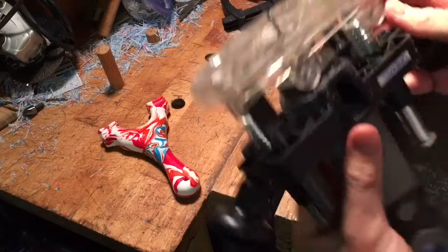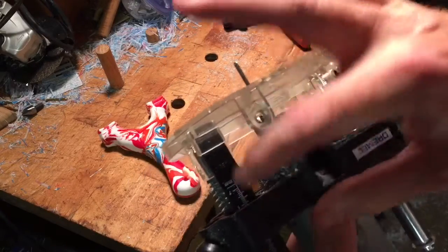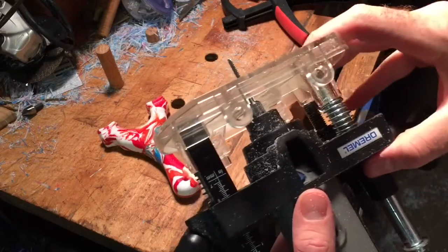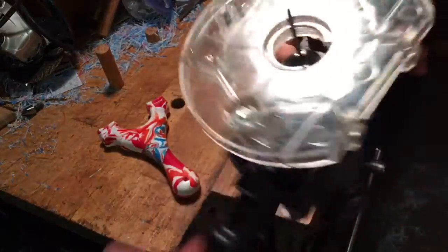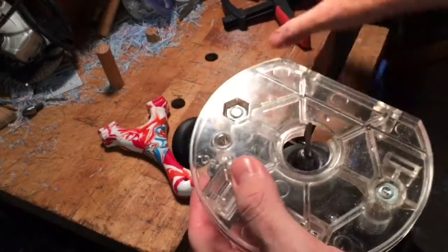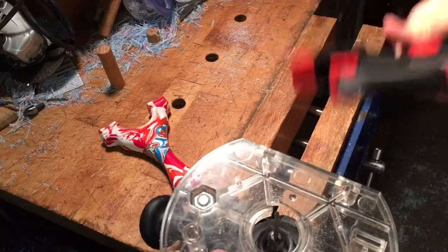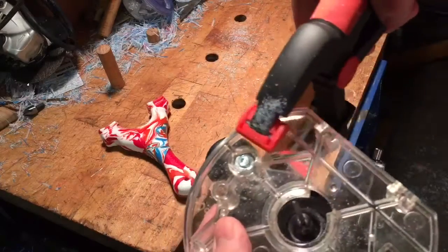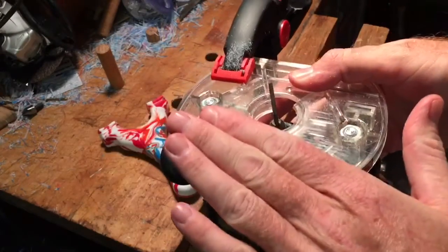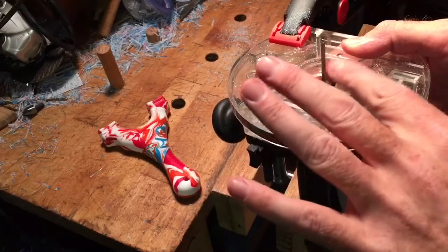Because I'm using it upside down, there's just a little bit of flex on this side. Once you lock this side down, the other side wants to push up and there's no lock over there. So if you're going to use it upside down like this — I usually use it like this because it offers a little more working area — you have to clamp down the other side. I'm just using whatever clamp you have. You have to clamp that side down because if it's uneven it doesn't line up perfectly square.